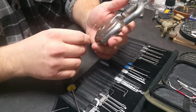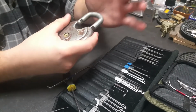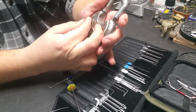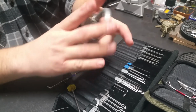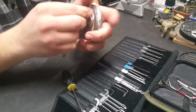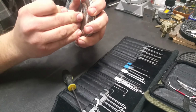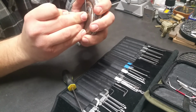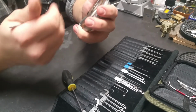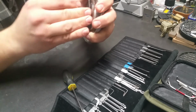And then the other thing is when you lock the cylinder with it open, you cannot relock the shackle. So I think that locking pawl probably slides in and then sits underneath the shackle, and that's what prevents it from closing again. So you would have to pick it open to be able to close it. And then, like I said, it's not too hard of a pick, so that's not too big a deal. Usually that's not too big a deal, but when you're trying to do it quick on camera for other people, that's when things never go the way they're supposed to, right?